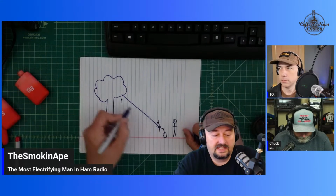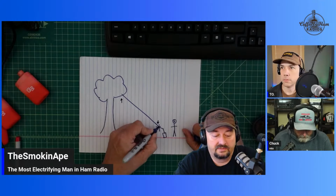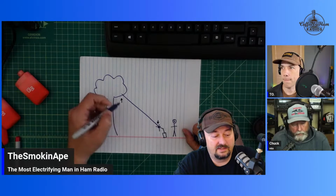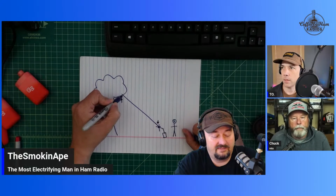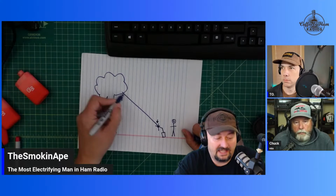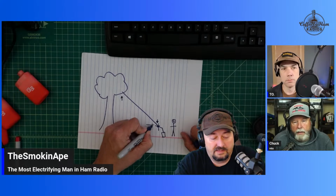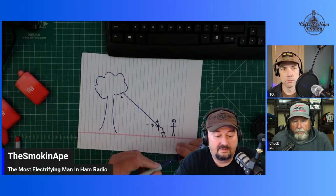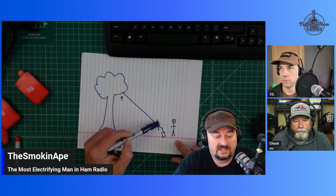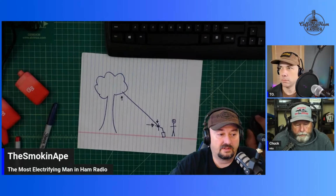And then once I get to the correct frequency that I want, then what I'll do is I'll heat shrink the lug on the end. Because I just need to disconnect it here, and it's easy, right? So if I have to take this down, then I take it down, I cut it, and then I got to get it back up in the tree, and hopefully my angle's the same and all that other stuff. And you could technically just take the wire and wrap it around the bolt, and not put your lug on right away. Adjust it right there is my recommendation for all.